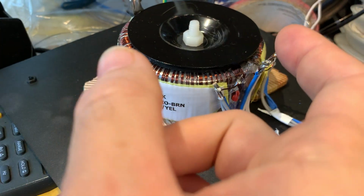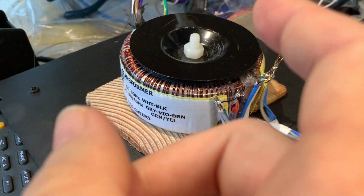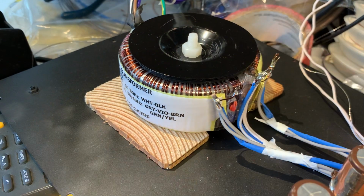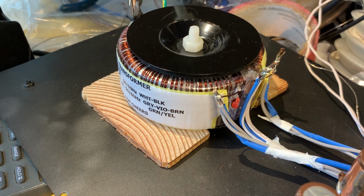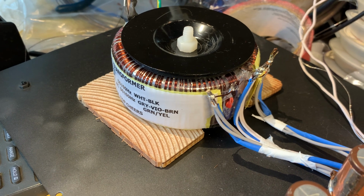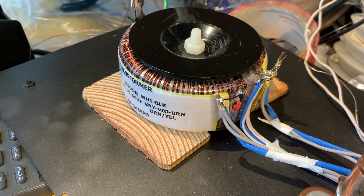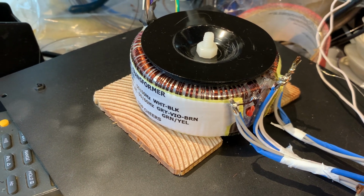So when your transformer operates, it hums a little bit, and if there's a plastic dampening the humming, then it will be an aperiodic element introduced into it. If you add wood, then wood dampens it in a different way, and what I have experienced in audio, and everyone who is using wood in their equipment has experienced, is that wood takes away a lot of those nasty colorations that would otherwise be introduced if you don't use anything or you use plastics to control your resonances.